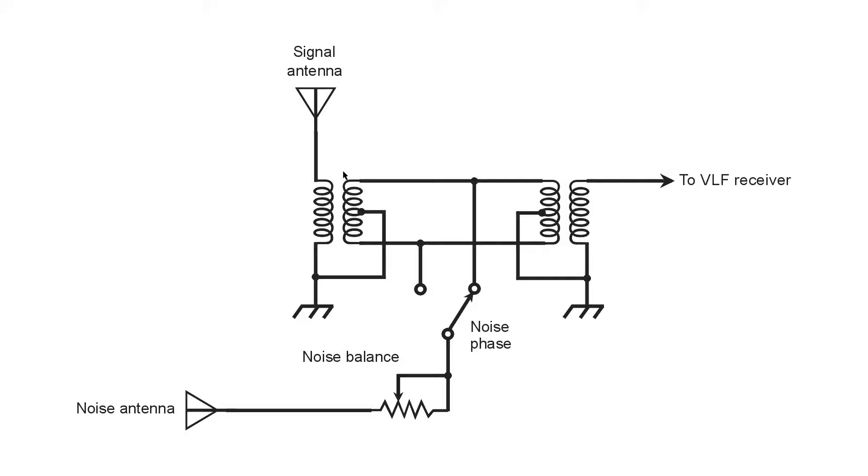I discovered that the AM mode has no audio filter in it, so it could convert signals all the way up to 60 or 70 kHz to low and very low frequencies as sidebands to an AM signal in the spot mode. This is the Drake T4X. Then, tuning away from the main carrier, I could receive the sidebands with the Drake R4A.